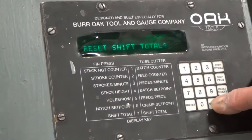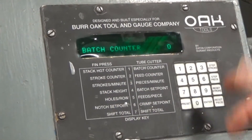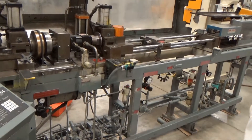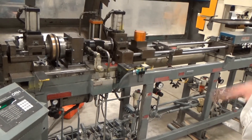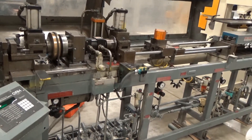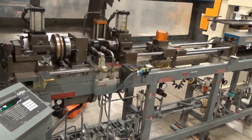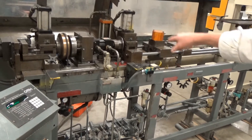Now we can get out of that and go back to our batch counter, which just starts at zero. Now we're going to feed out twice per part and it only counts one. No feed — now we go in. That was one part. Double feed. And back in. Now we'll just count to ten doing this.